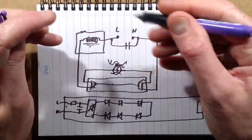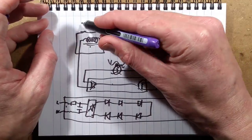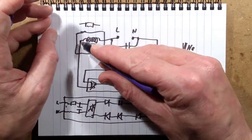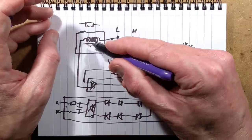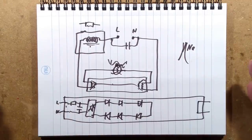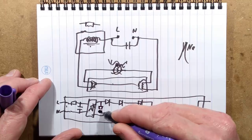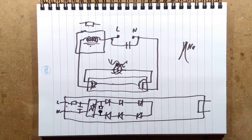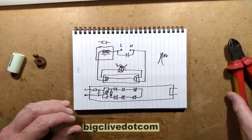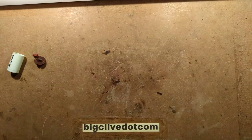If you use the formula XL = 2πFL, you can get an equivalent resistor value for the inductance in an AC circuit — so it acts as a fairly low-loss resistor. I'd guess that to reduce power they've increased the number of LEDs so the voltage across them is higher. That might also suggest there's a smoothing capacitor to prevent flicker, since theoretically it will only conduct near the top of the sine wave. Let's open it up and see if I'm just talking crap.